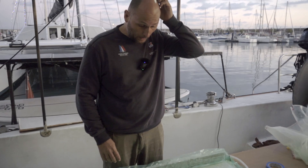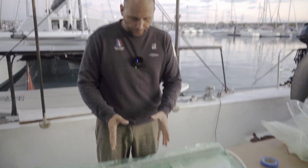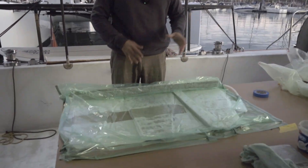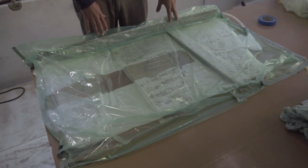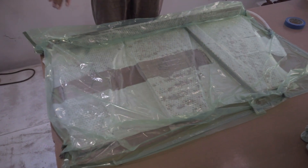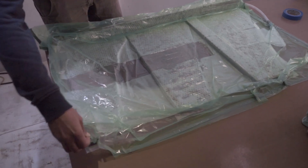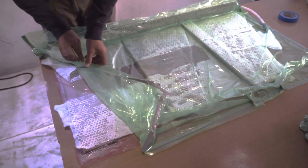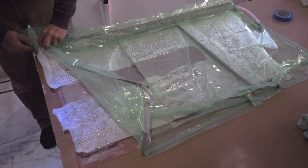So you saw the bunk. These are the dividers that will make up the cabinets to hold our undies and t-shirts and stuff like that. They were built with return flanges, thickness and all the rest. And to make sure everything's flat, I've made it on my makeshift flat table. Again, I vacuum bagged it. Because I don't have a vacuum gauge and I've been guessing a bit, I may have boiled this one again - I talked about boiling polyester in a couple of videos ago.